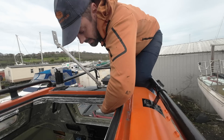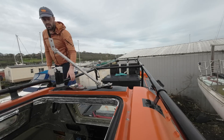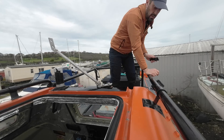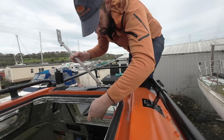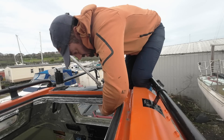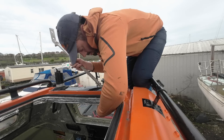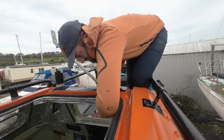I wasn't overly looking forward to the spanner-tightening final act, as I knew from before it has to be done balancing high on top of the boat at a weird angle, blind to the underside, which itself is recessed into the insulation foam. I did fumble and drop the steel plate on the underside and had to fetch it, although I don't think it hit anything important. So that was complete, and I will prime and paint the brace, the squeezed-out sealant, and the mast again once I'm ready to call the mast structure complete.